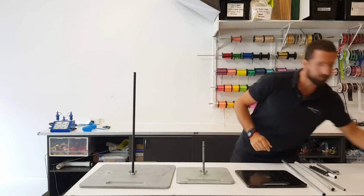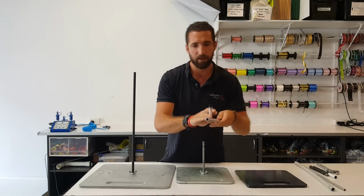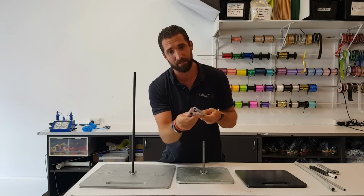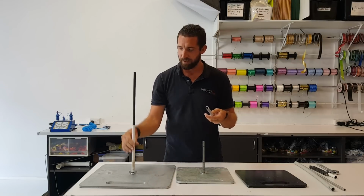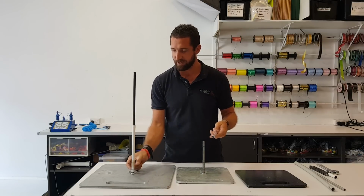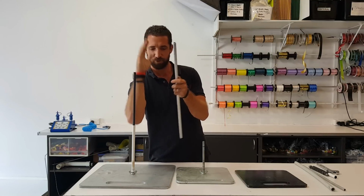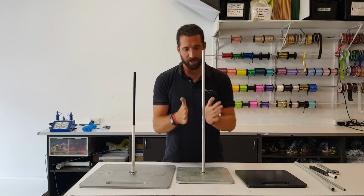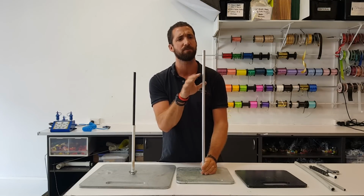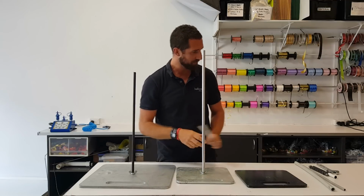And another example of just the curtain rod. That's a little bit looser because the outer skin is not as thick as the aluminium, so it's just a little bit looser, but that's fine. So I would use then a longer threaded rod because the variance between the base at an angle to the top at an angle isn't much. So I'll only just tip a little bit, which you won't even notice. But I find aluminium tubing, this is a 16 mil, I think it's a 1.2 or a 2 mil thickness, to be just as cheap as your lengths of curtain rod as well.